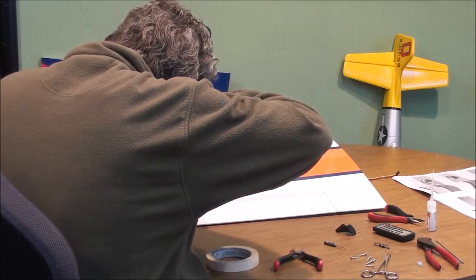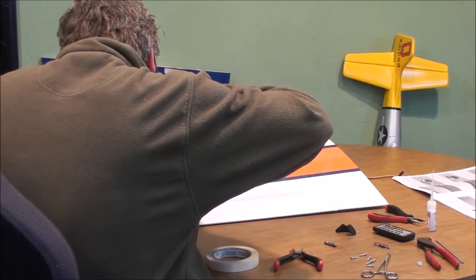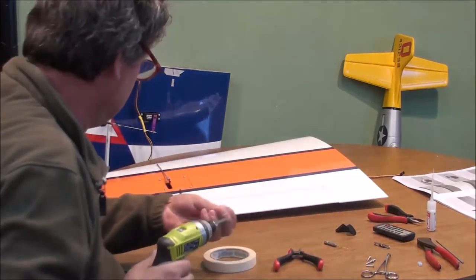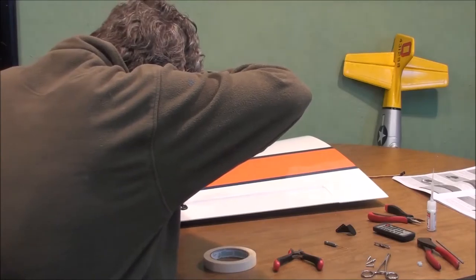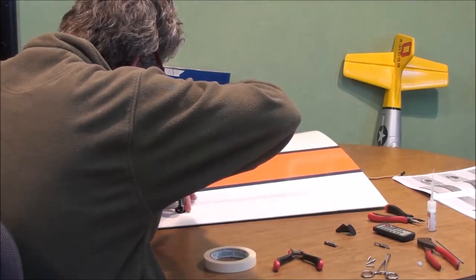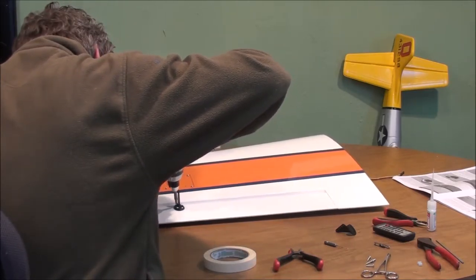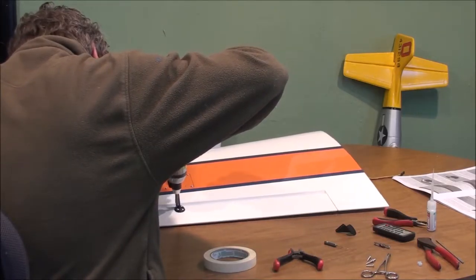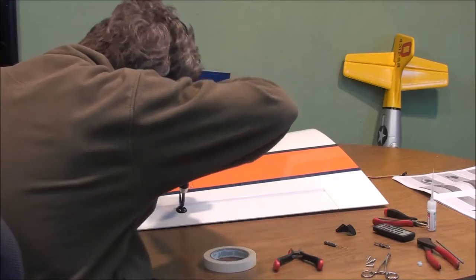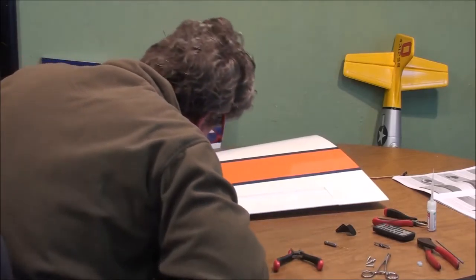I don't run them all the way up tight with my little drill — I probably could on a one setting. I'll try it; if it kicks out on a one setting when they're fairly tight, I could probably get by with it. I usually don't. Make sure the bit is fitting your screw head well. It actually works. These are a little bigger screws. The clutch is pretty accurate — don't over-tighten them. You just want to start indenting the wood.